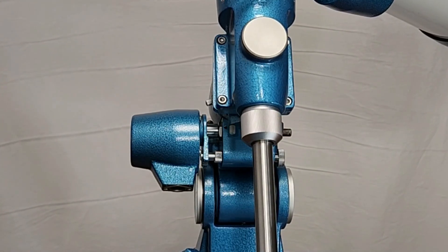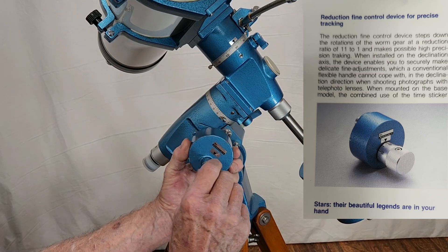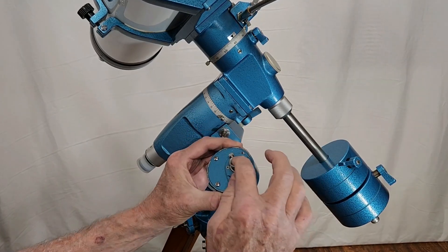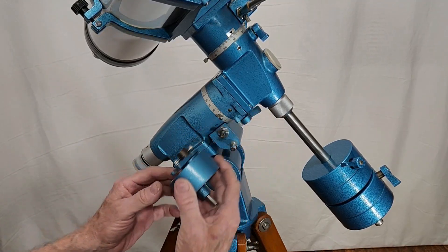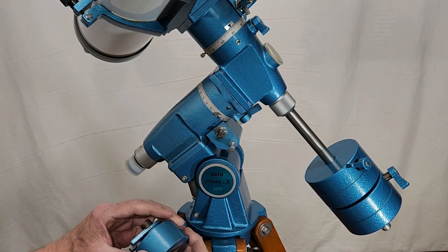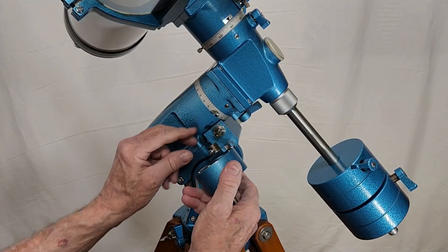Plug in my tracker, and I'm good to go. This little device is a poor man's clock drive — a manual clock drive, if you will. This is just a speed reducer. You turn this at a certain rate, and this is turning at about one tenth or so of the rate that you put in here.